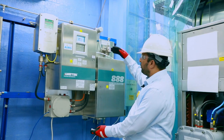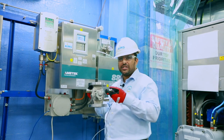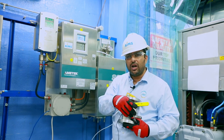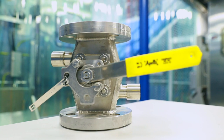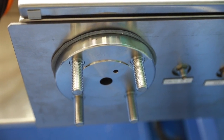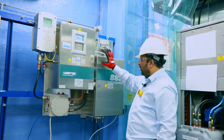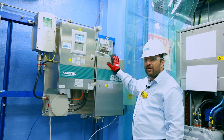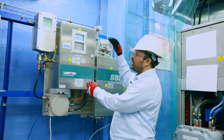The Triple Eight analyzer is directly mounted on your tail gas line. Below it is a two-inch steam jacketed isolation valve with steam connection in and out. Once the probe is inserted through this valve, you cannot isolate it. The analyzer is also called a closed-coupled analyzer and has two sections: one is the electronics enclosure and one is the sample conditioning and sample handling section. Everything in this box is heated to 150 degrees C, above the sulfur dew point.